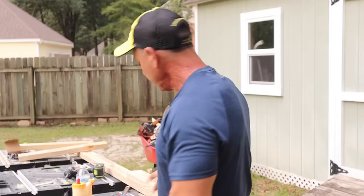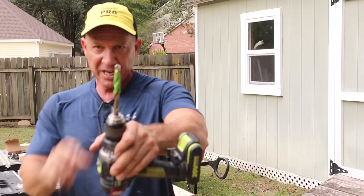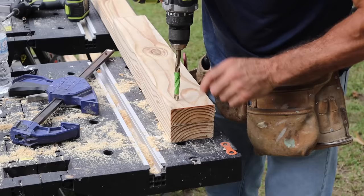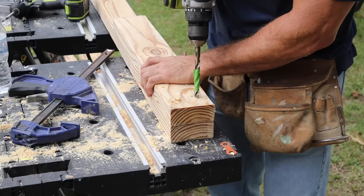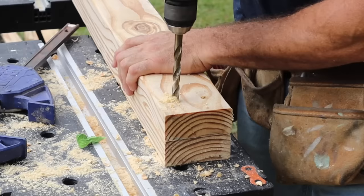This board is an inch and a half thick so I don't want to go past three quarters of an inch deep. I'll put a piece of tape to show you — I eyeball it normally, but right now I'm about five eighths of an inch down, no more than three quarters at most. I'm about an inch and a half back. After I do that I'm spinning the screw in, and you can see I'm biting into this part.